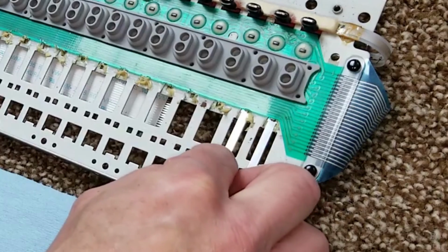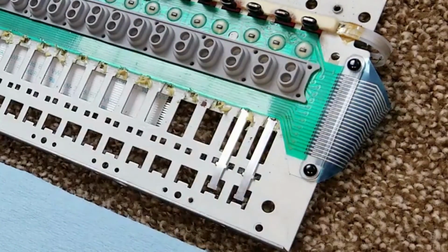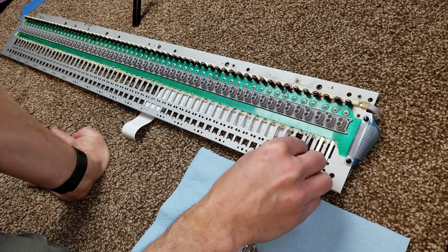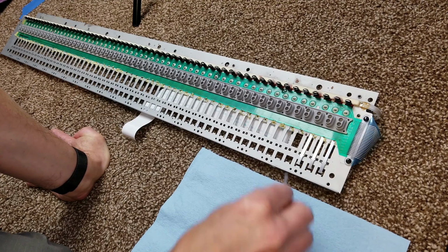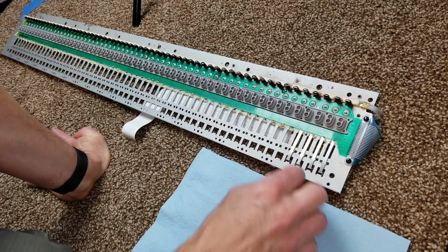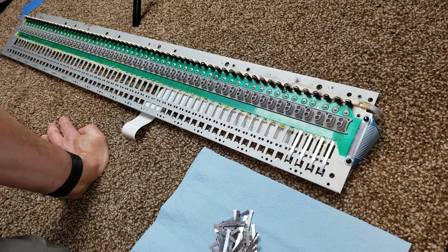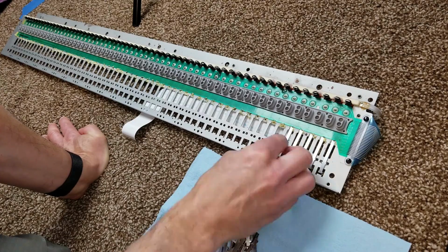And then the distal end from that hinge just hangs in midair like you can see there. Now there should be just enough grease to hold the spring in place like you see here. The legs will hold it in place side to side, and the grease will hold the end so the spring doesn't fall out. This is actually a very delicate job.